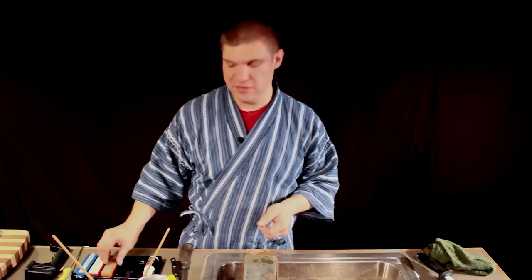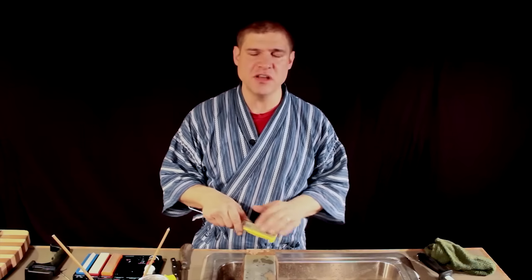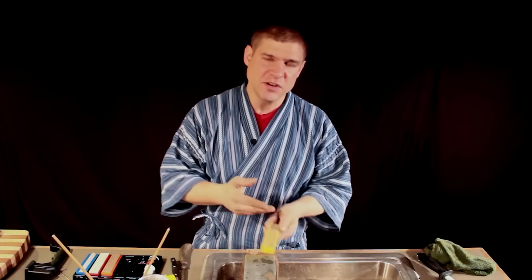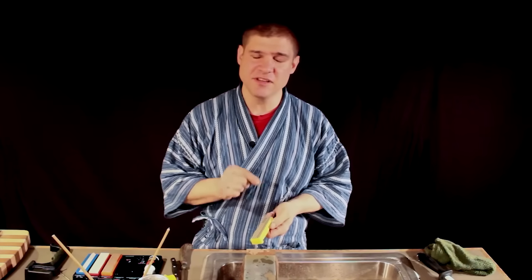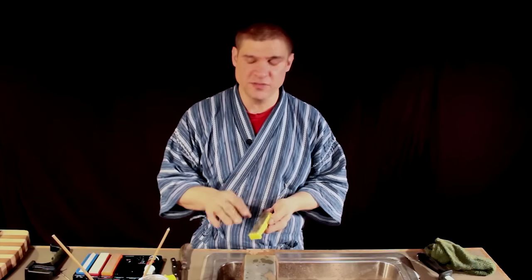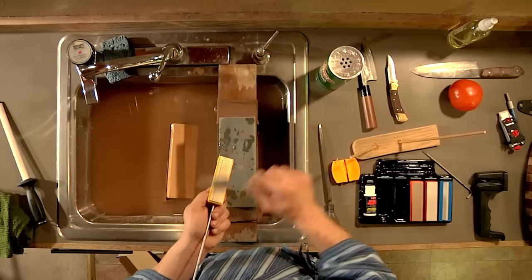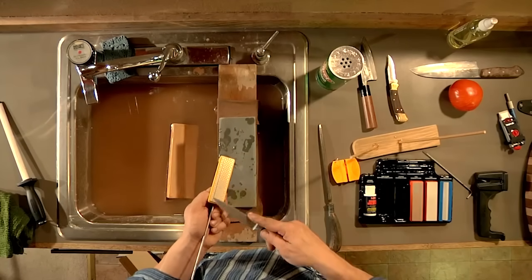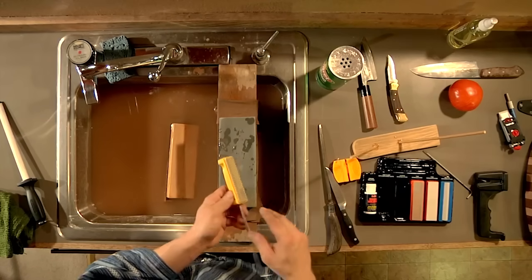We already talked about the deficiency of diamond hones, and that is that, A, diamonds are so much harder than steel that even if you try to just lightly burnish the edge, like as in step 6, those diamonds cut really deep furrows in the edge of the blade. And when an edge fails, usually it's where those deep furrows are that the little carbides or the edge basically breaks and chips off. But if this is all you had, again, you're always going to get better results by stropping backwards than by stropping forwards or by cutting into the stone.